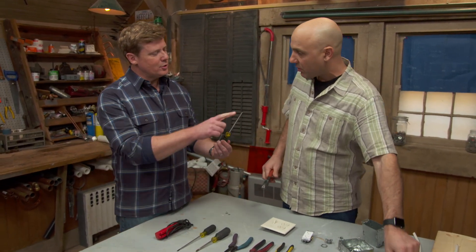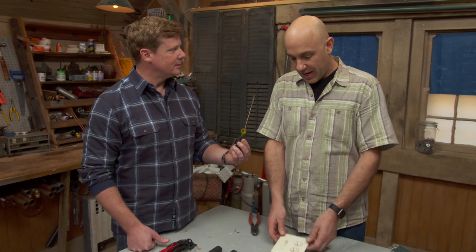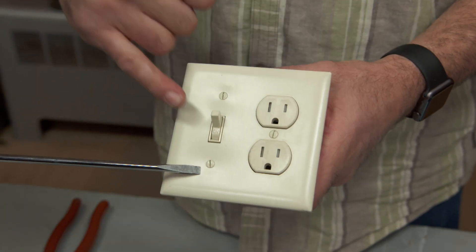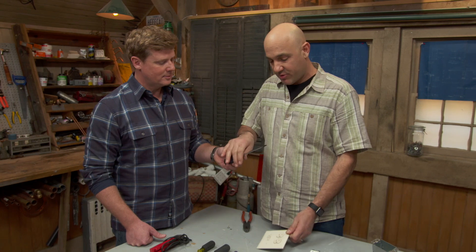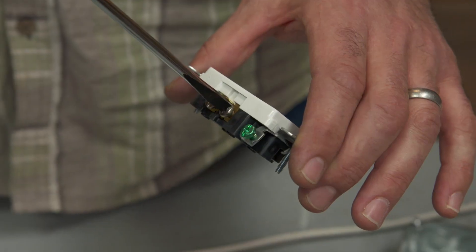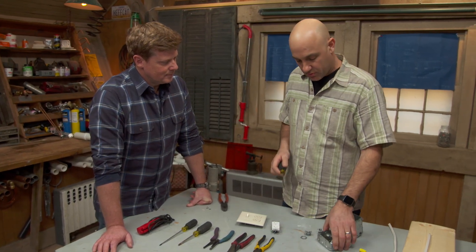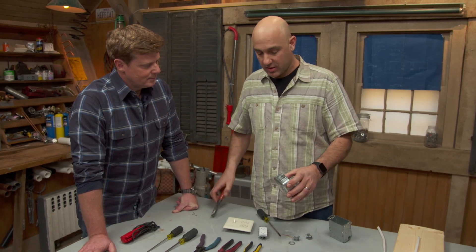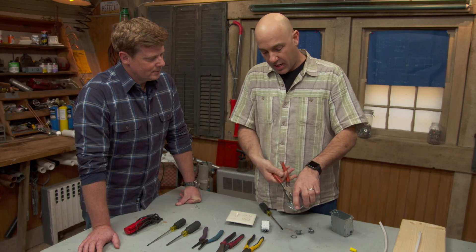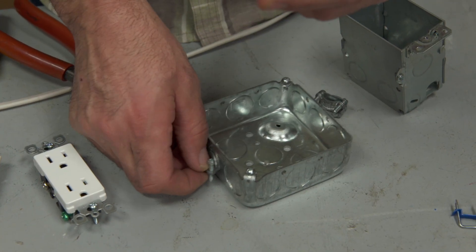And then in terms of the screwdriver, you choose a flat tip. You don't choose Phillips and flat — why just flat? Our first point of access is usually the cover, and these are all slotted screwdrivers, so we have to take that off to get to it. And this flat tip will do the same thing on a device that has a Phillips and a flat tip, so we always get there and can get a good turn on it. We also have to take the lock nuts, the knockouts out, so we use this tool here, bang that out, twist it out, put the connector in — they call it a lock nut.